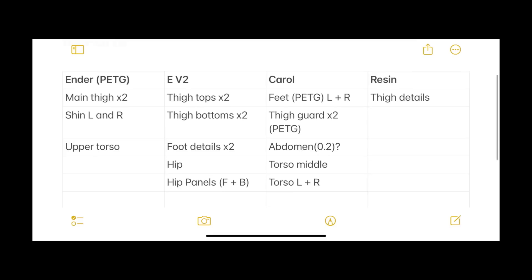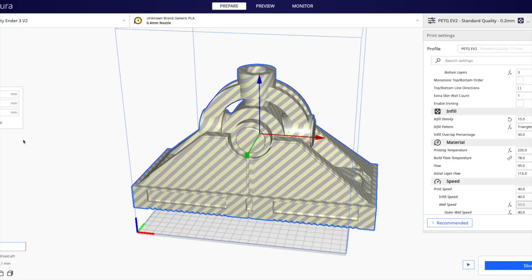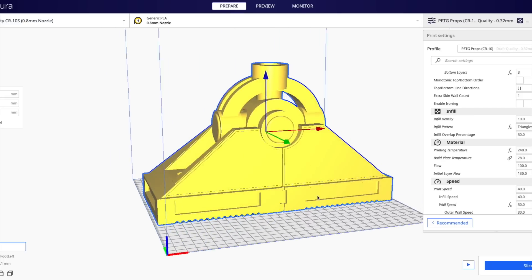To keep myself organized, I did something I don't think I've actually done before — I made a list of all of my printers and figured out which way I wanted the pieces printed. Some pieces have to go on my CR-10s just because they're larger. There are always sliced versions of any big pieces that could fit on an Ender-size print bed, but I have a big printer so I might as well just print it in one piece so that it's less work for me later. And then there are some pieces that I want printed a certain way — my one Ender tends to have a 0.8 nozzle on it all the time and my V2s have 0.4 nozzles.